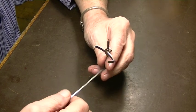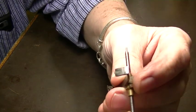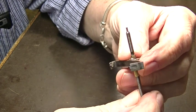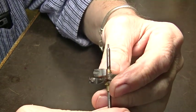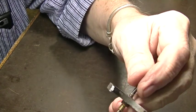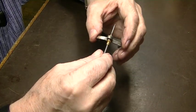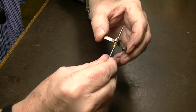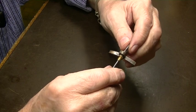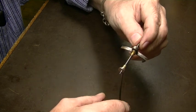We got this all cleaned up and assembled. There you can see, there it is. I said I used epoxy to put those in, and then I polished them again just to make real sure. And this is just a press fit on here. This is actually still loose, and we're going to leave it loose until we find out for sure exactly where it's when the clock's in beat.